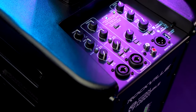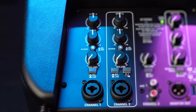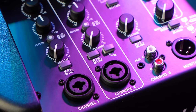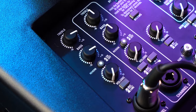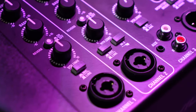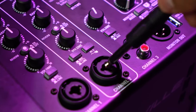On top of the subwoofer is the mixer portion of the system. On both channels one and two, there is a two-band treble and bass knob EQ to fine-tune the sound of your inputs, and both channels feature a selectable mic or line combo jack so that you can plug in either an XLR cable or a quarter-inch cable. Both channels feature a reverb effect that you can toggle on or off, and the only difference between the two channels is that channel two has a high-Z mode, where if you press this button, you can plug in an instrument like a guitar, bass, or synth.